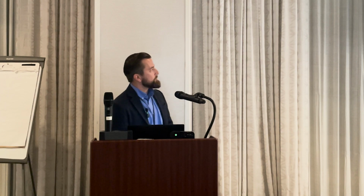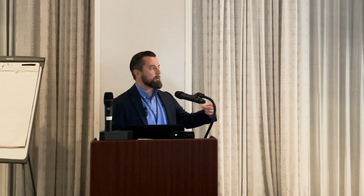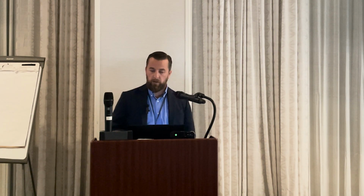Well, some of them just have engineering problems. In these pictures, what I'm trying to show is sort of an earthworm type thing, where you're seeing a bunch of overwraps on socket adhesive joints. There are owners, and I'm not opposed to this, who say, okay, you want to do a socket adhesive joint? I'm good with that. It's quicker to install, but I also want you to overwrap it so we get the benefit of the laminated joint. So that's not a problem.